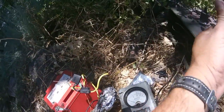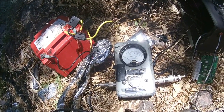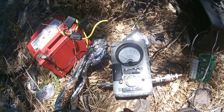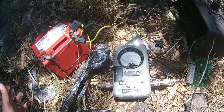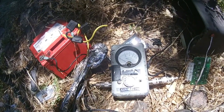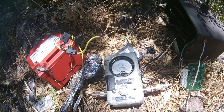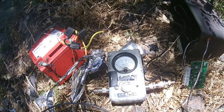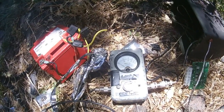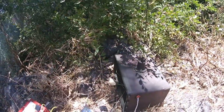Now let's see what's being reflected back. That looks like one watt, or maybe 0.85 of a watt. So the ten percent rule of thumb is no more than ten percent coming back down to the radio. The minimum with that would be 0.35 of a watt. We're getting something that looks like 0.85 of a watt, so we do have some reflective power going back. That's unacceptable.